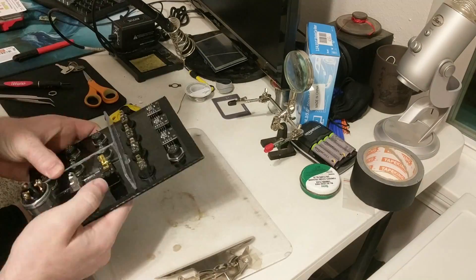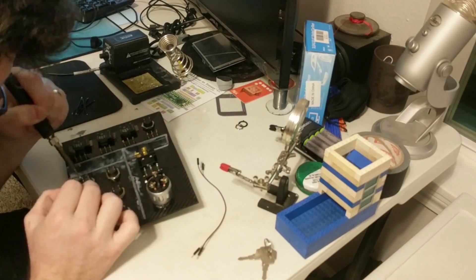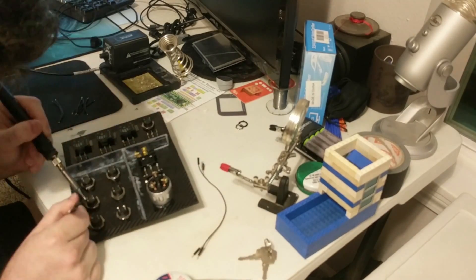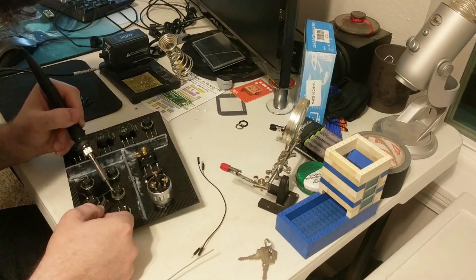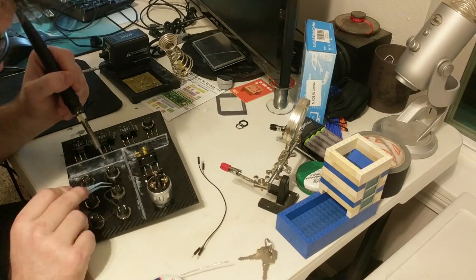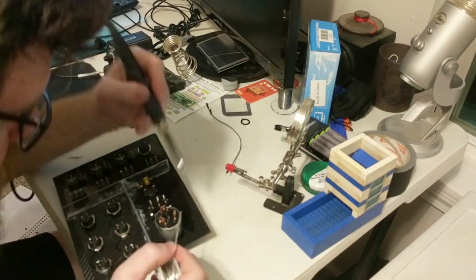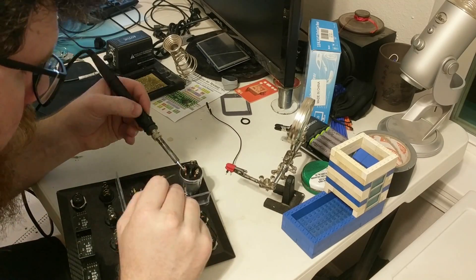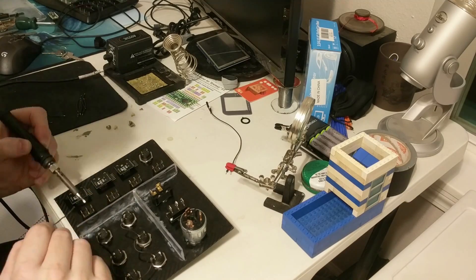The ribs end about a quarter inch from the end of the plastic for clearance purposes. Now for the soldering — I went through and tinned all of the connections ahead of time. For the red buttons I used a very low heat setting on my soldering iron since the high heat tended to melt the plastic the connections were housed in. For the larger parts like the switch and key assembly I used a high heat setting since they absorb a lot of heat.